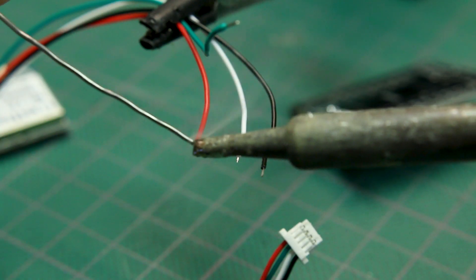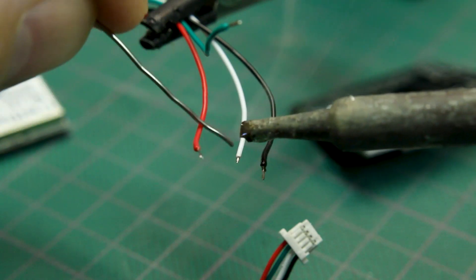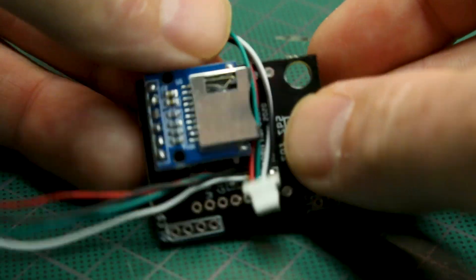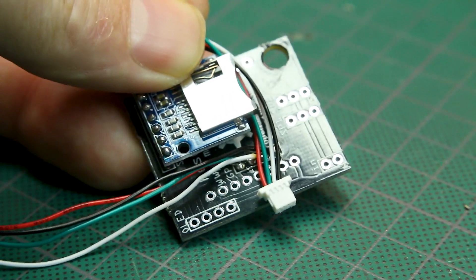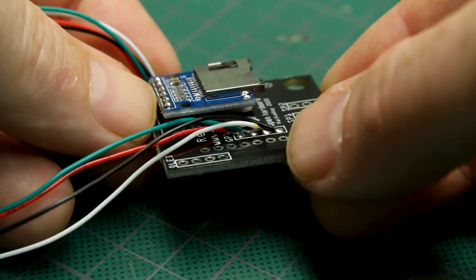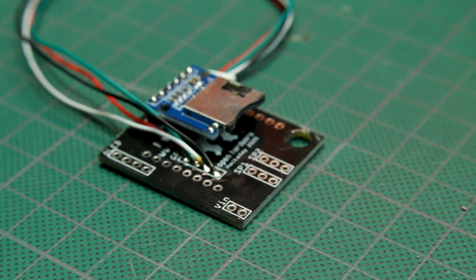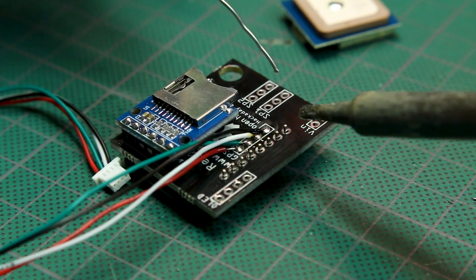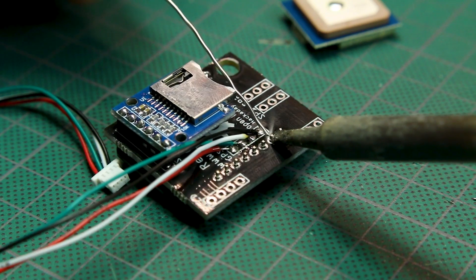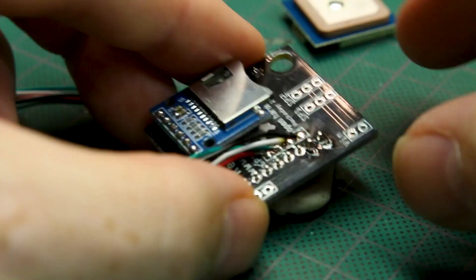Our GPS interface has four wires: receive, transmit, power, and ground. In this case, I just tacked the wires to the top side of the board on purpose, so that I don't put them through the board and can easily disconnect them from the top when the board is installed in the enclosure. They don't always need to be through the holes — you can just tack things on the top. A little bit of hot glue to hold it on — that way disassembly and reassembly is a lot easier. Go ahead and solder the rest of the connections on the board for the Wemos D1 Mini.